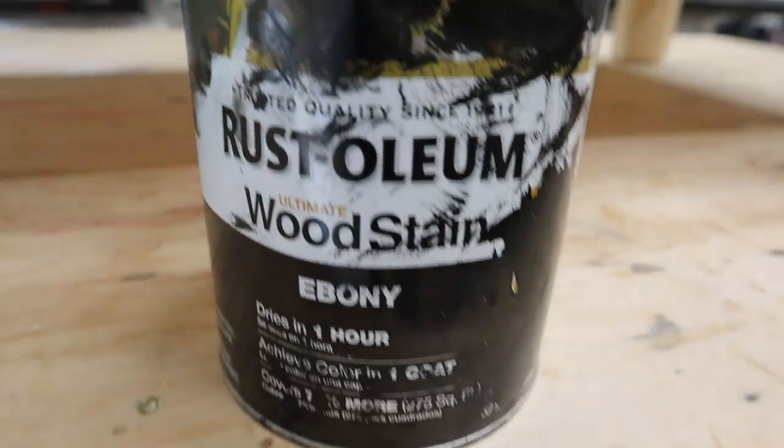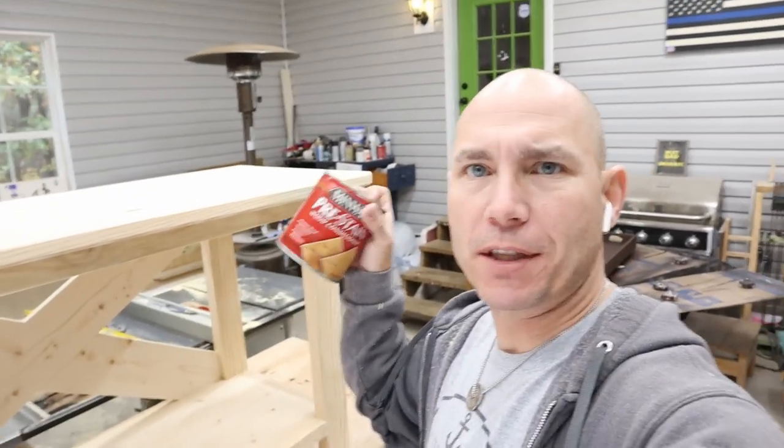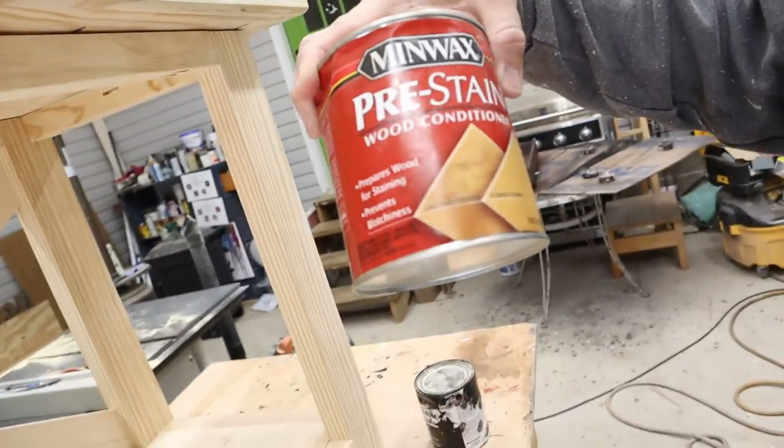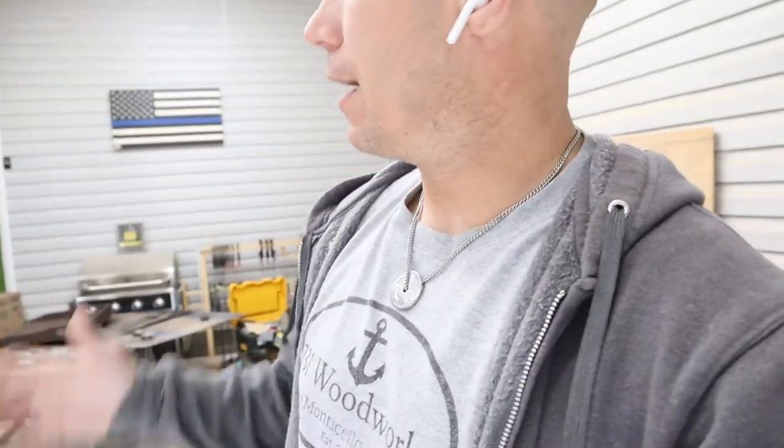We're going to stain this whole thing in ebony — this is what the customer wants. We're going with the Rust-Oleum ebony stain. The first thing I'm going to do is put this Minwax pre-stain conditioner on there. If you've watched any of my videos where I've stained anything, you know I'm a believer in that stuff. It keeps it from having blotchiness — a lot of times a dark color like black will pop through in real dark blotchy spots, as shown on the can, unconditioned versus conditioned. You'll see that especially in the spruce and also in the yellow pine. I highly recommend using it. I'll just wipe this down fairly liberally — I want it to coat the surface. I'm only going to put the pre-stain conditioner on the top surfaces, then I'll stain everything underneath as well. Let that pre-stain conditioner dry at least 30 minutes, no longer than 45 minutes to an hour before you put your stain on. I'm going to take the top off and stain it separately because it makes it easier.